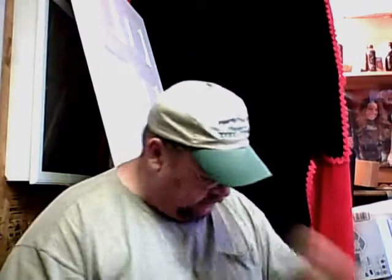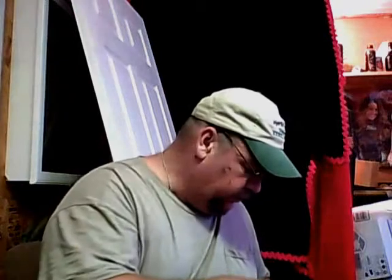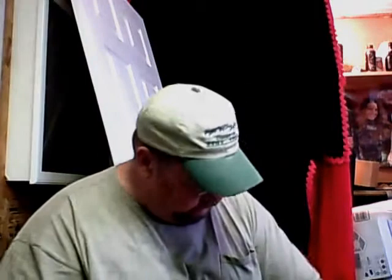Ooh, that's getting pretty warm down there. Heated up a little more than I wanted to. Turn this over. Finish warming this back up right here. Go back down a time or two. Roll it a little bit. And all I'm doing is just heating this barrel up. All right, let's try another coat of blue.